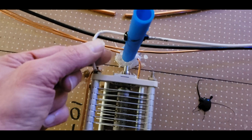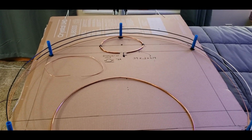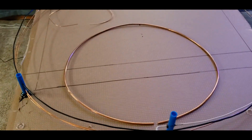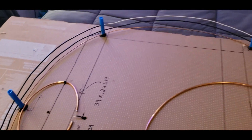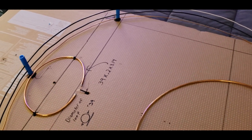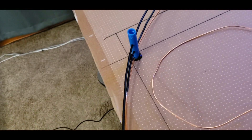Get the ends as close together as you can down here so your connections are close enough for the capacitor. I tried it at different widths — I had it at about four feet diameter and it did okay but wasn't very resonant. I shrunk it down to 39 inches. That doesn't mean 40 meters, that's just the diameter of the loop. This is just cheap house wire.